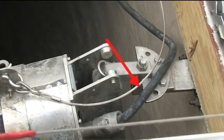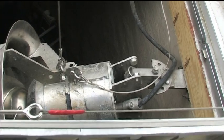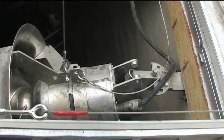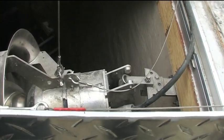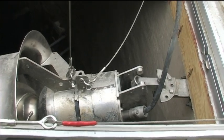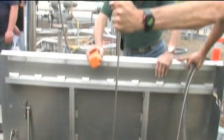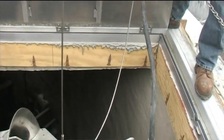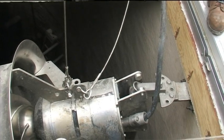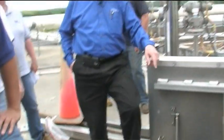You see the power cable? The wire rope goes along the power cable — you can see the cable holder is holding it. That's the support cable. When the mixer reaches the desired height, that wire rope should be taut, not loose. Never use that wire rope to lift the mixer — it's not strong enough, you'll kill yourself. Only use the wire rope assembly that's on the crane. Could you use it for an emergency? No, it's not the same size. That cable can lift three times the weight of that mixer.